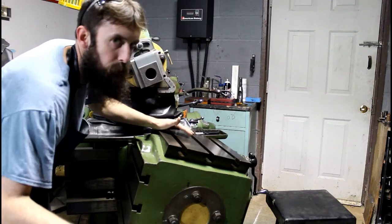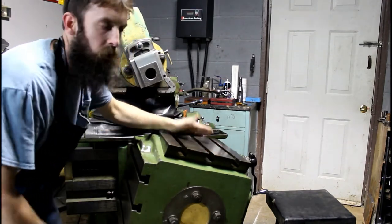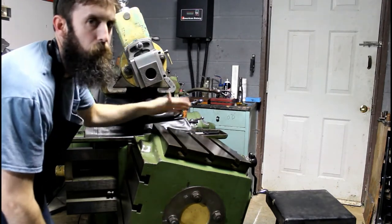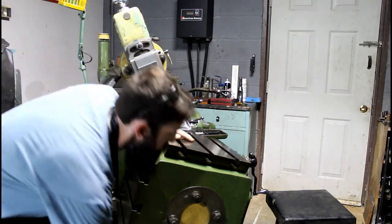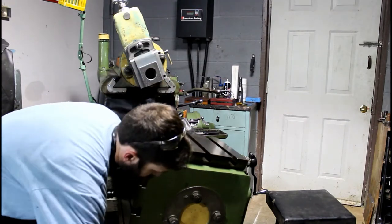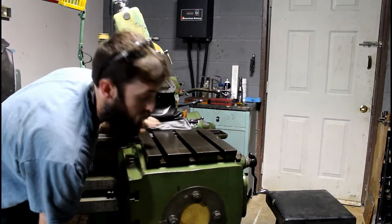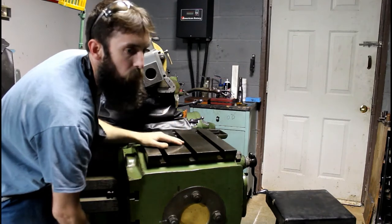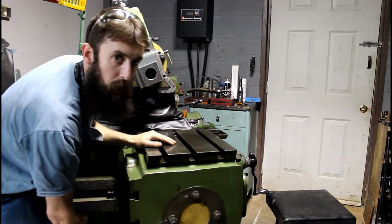Alright, my first step is always to get this table parallel with its movement. Nothing on this shaper has to be trued up in order for us to achieve this. The first and most obvious thing is to line up our zeros. Most shaper tables rotate, and we can line up our zeros and that gets us pretty close. But we want to refine it more than that — we want to be within at least a thousandth or two. I'm going to bring you in a little closer and show you how I do it.